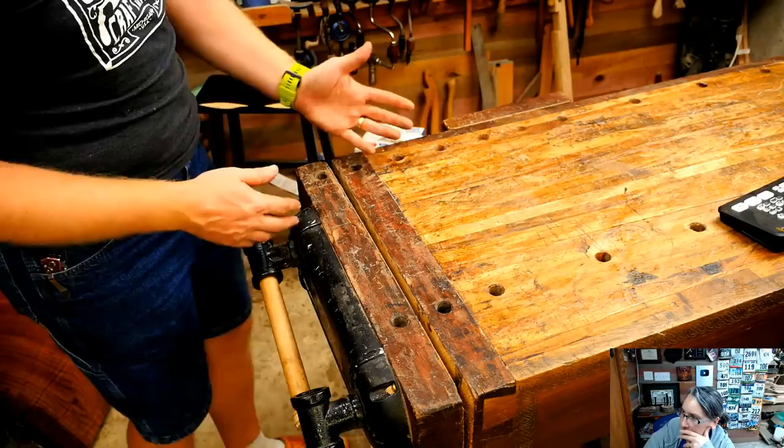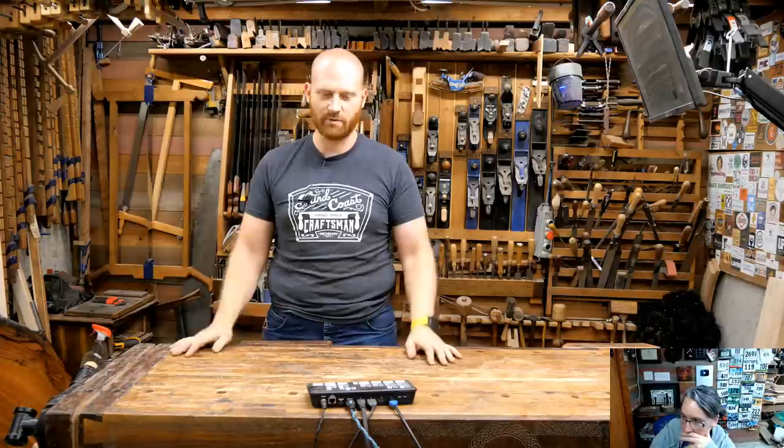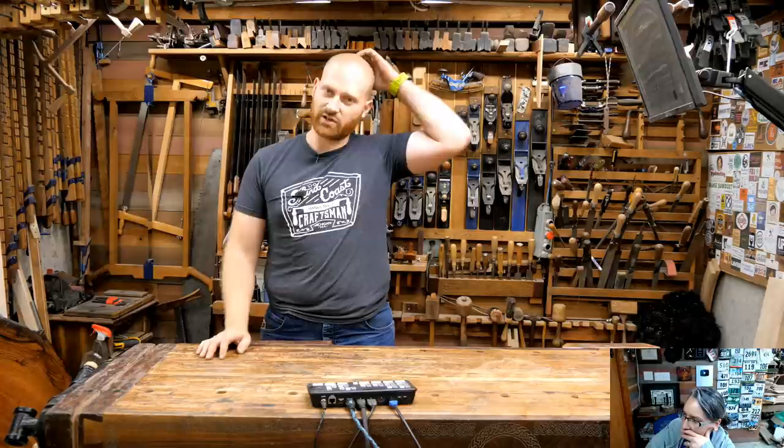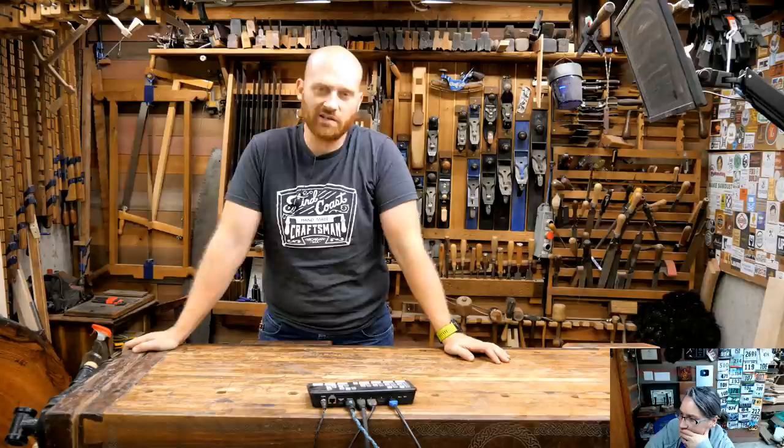You've got to think through how the surface would have been used and how it would actually have been beat up over time, and try to duplicate that. A lot of intentional wearing I actually like to do with chains. You can beat the wood down with that. What's the word I'm looking for? Flap discs on grinders, anytime you need to take off a decent amount of material.